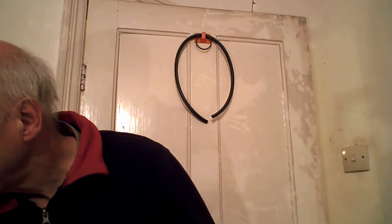Meanwhile, there's plenty to do. I've been to a nice hardware shop just out of town and I've got some screws, two taps in case I break one — because you have to be careful, especially in blind holes. These small taps, if you break one, it can be very discouraging. However, because I've got two and I know more or less what I'm going to do now.